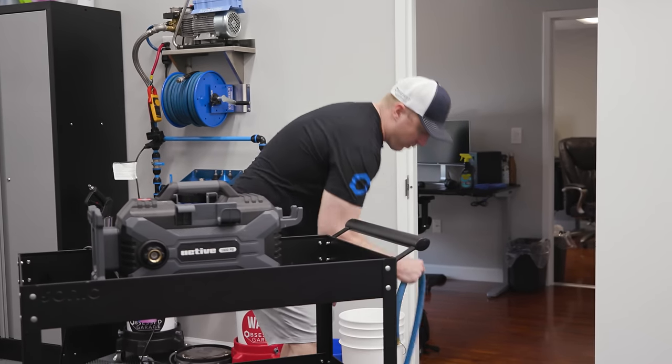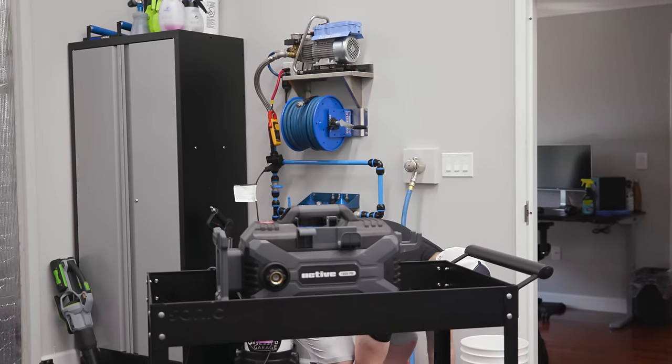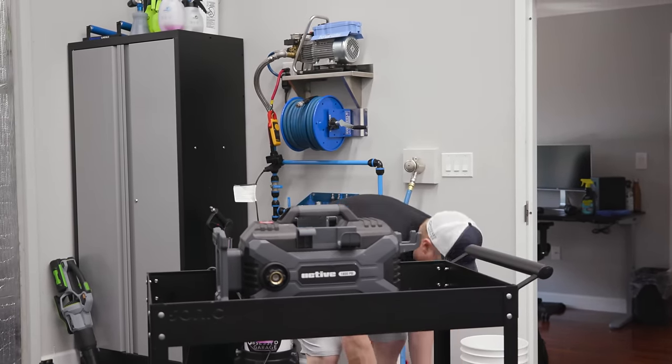And so no matter which one of our packages you buy, we're going to send it with two sets. Remember? Watch. You get that? It comes apart. So you're going to take the male end of the hose, put a female coupler on. You can even look inside here, and if the O-ring starts to warp, or if you find that this fitting is having a hard time seating, that's when you'll know you've gone too tight. Again, hand tight is probably enough. You could tape it, but tape really isn't going to do much on this.